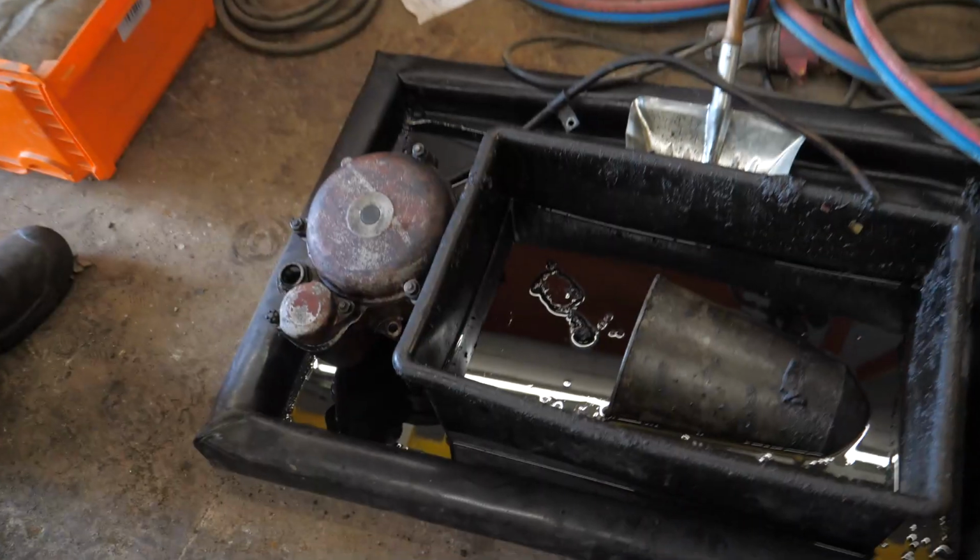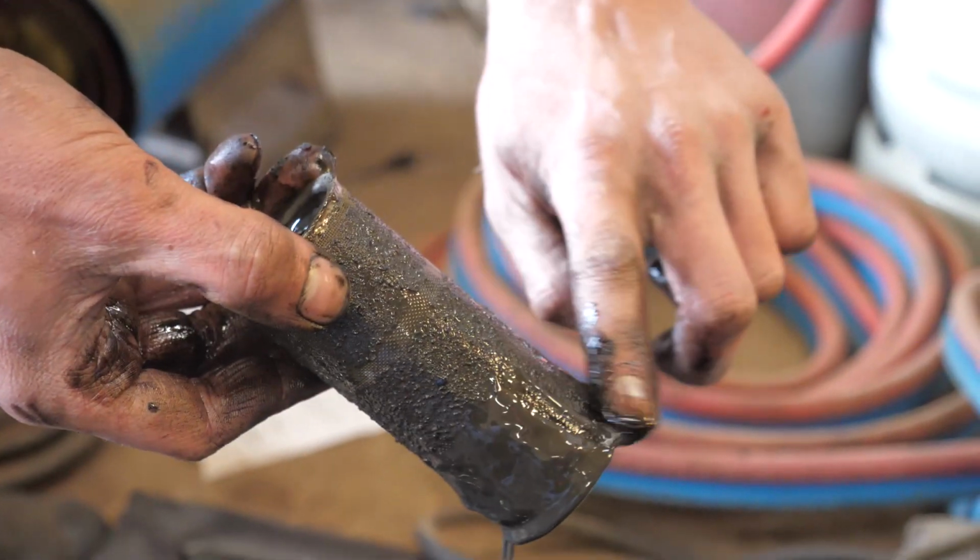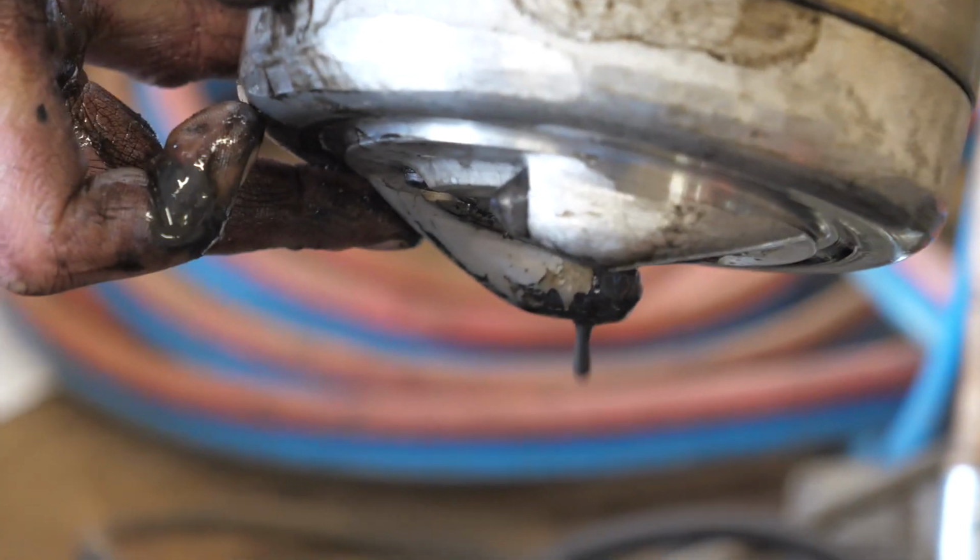Okay, well, good. Then we proceeded with cleaning of parts we took off from the engine, and we took the centrifugal filter. This is an oil filter. It's on top of the engine. It has a coarse filter. It's just a sieve where the oil goes through, and after this sieve it will enter the centrifugal filter. It's just a drum on which the oil pressure is applied. It has two nozzles, and when they start spraying oil, they propel this drum so it starts spinning. Because of this spinning, all contamination in the oil will be swung outside by the centrifugal force, and it will be collected inside of this drum. So you have to clean this drum and also this coarse filter sometimes.